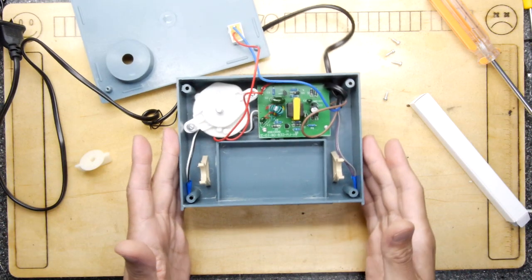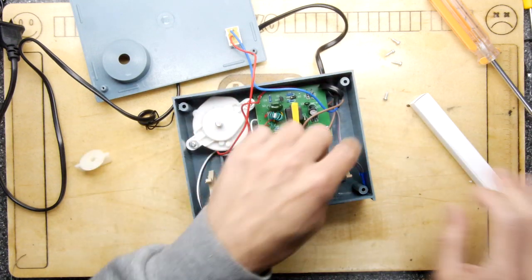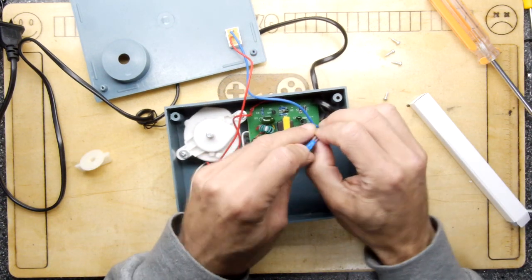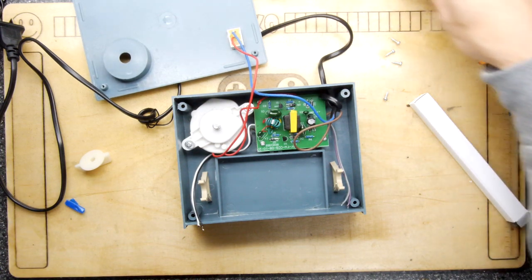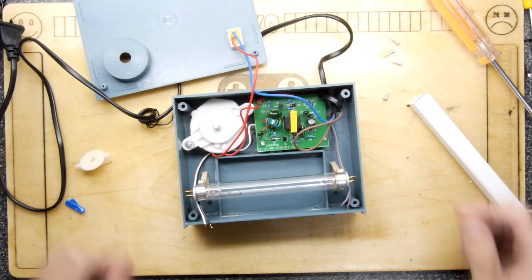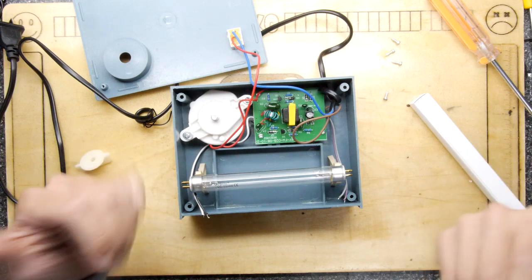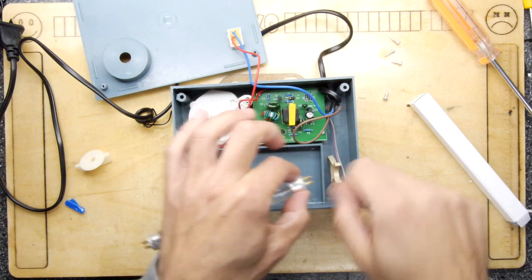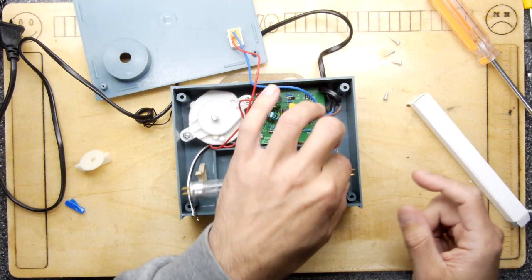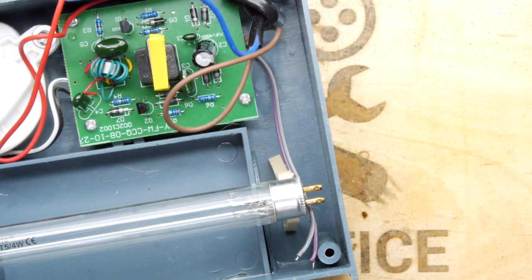If you recall, we opened this up - look at my last video if you didn't see what I was doing. The problem with these is that they are actually soldered in. I could have bought something to let you clip these in, but I didn't, so I just bought a bulb. We're going to go through the replacement process. Make sure it's unplugged, because when I went to desolder it, it wasn't unplugged and I blew out all the fuses in my house - that was not good.